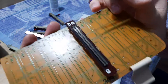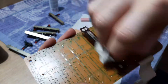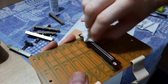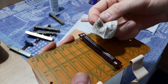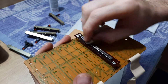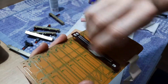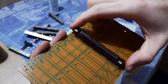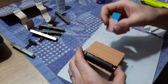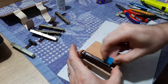Look how much dirt is on this one — a lot of dirt. This is why we ask ourselves why potentiometers are scratching. All of them are the same, because over the years people have been pushing inside a lot of stuff: contact cleaners, WD-40 — I found some here — and other chemicals that people had on hand. None of it was enough, but it spread around and built up.